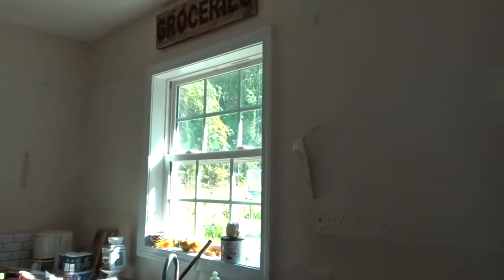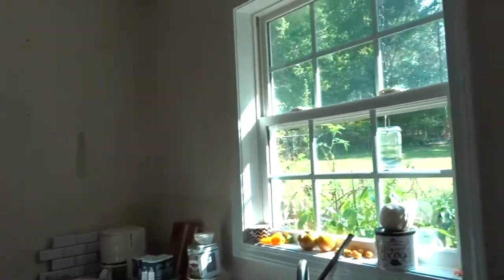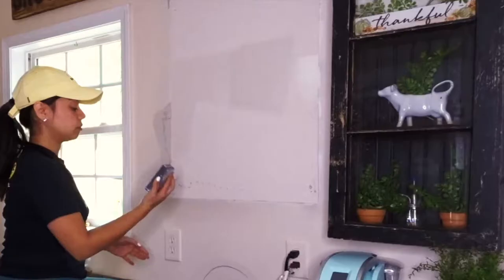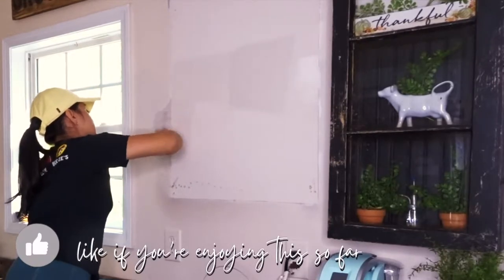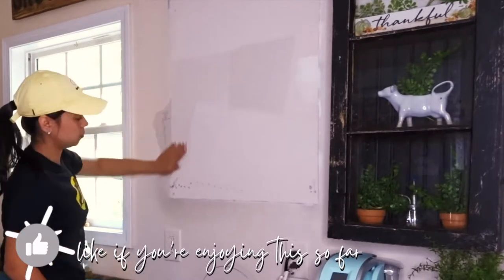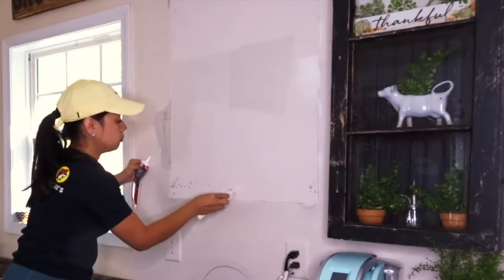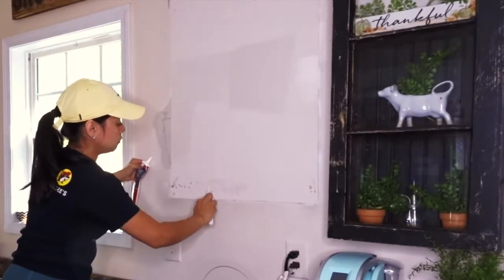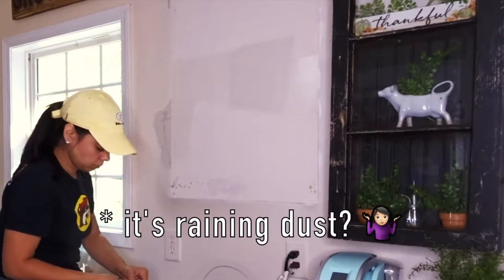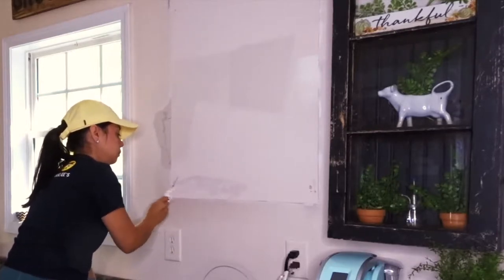Once the cabinets were removed, it did peel off a lot of paint around the edges of the cabinet, so you can see in some spots the sheetrock and of course some of the holes where the cabinets were screwed into the wall. To make everything level with the areas that were peeled, I am taking a Dollar Tree sanding block and just sanding around the areas where it did peel, so that way it's all smooth. And then I'm going to take some Dollar Tree spackle or caulk and spatulating it into the holes of where the screws were existing from the cabinets.